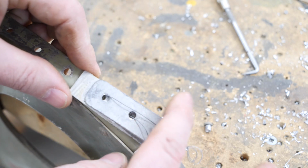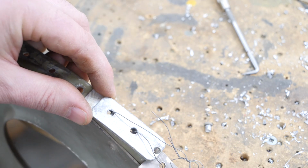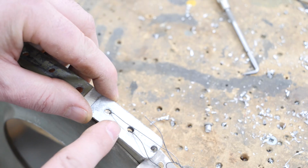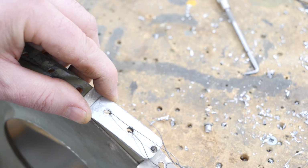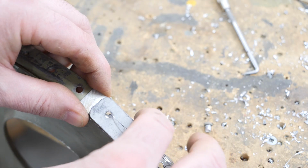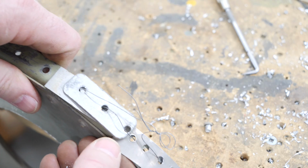Another thing is these shims specifically. This one here has a part number. It's a mass-produced item and part of the aircraft. I found it on almost every rib in the nose area to allow the skin to contour smoothly over to the strap doubler that goes between the upper and lower skins on the torsion box. But what I found underneath is there's a lot of these smaller ones, and they're just almost haphazardly cut out of scrap aluminum.